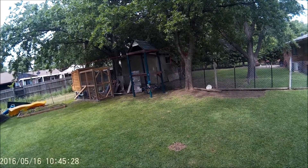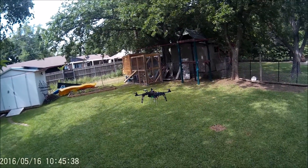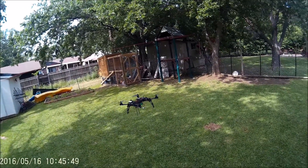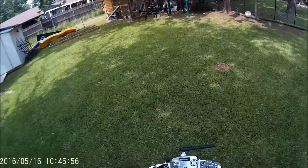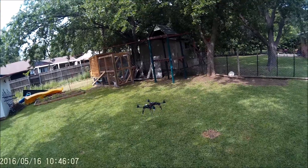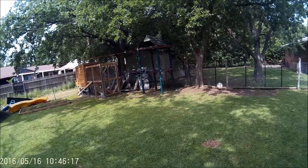We still have a yellow LED. The GPS hold does make it fly a lot better than that cheap quad I had — it's definitely a lot easier to control. You still have to make corrections; it doesn't hover in one spot exactly. It keeps going down, so I think we might actually be a little underpowered for our motors. It should hover at about 50% power, but you have to go up to about 60%, so we may be a bit heavy.